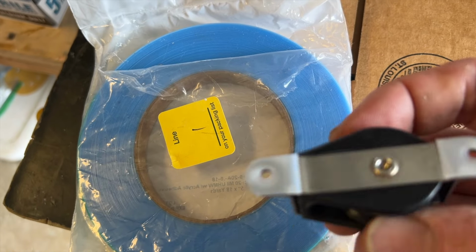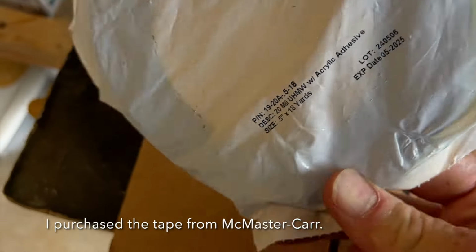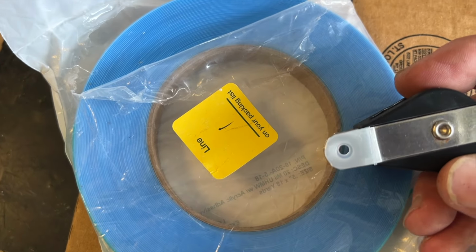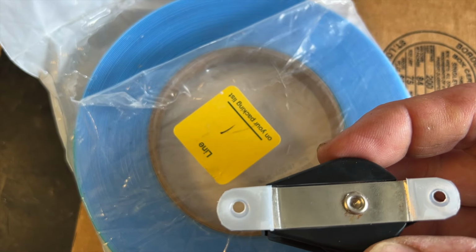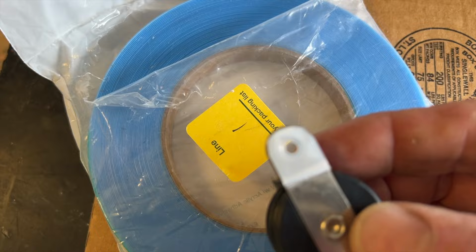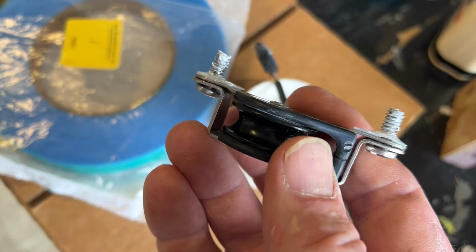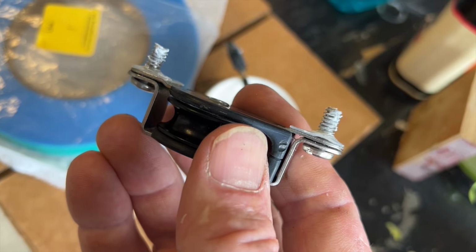So what I'm doing now is I'm putting a little bit of this UHMW tape. It's adhesive on one side. I got it from my Tristle track because it's stainless. You don't want to put that on aluminum; that's a barrier between it. So these are my lazy jack blocks. You can see I just put a little bit of it on there and trace or trim it with a razor blade. Then I'll put it on the boom. So there's the fasteners. These are 10-24s with the Tef-Gel. And I just screw that right into the boom.